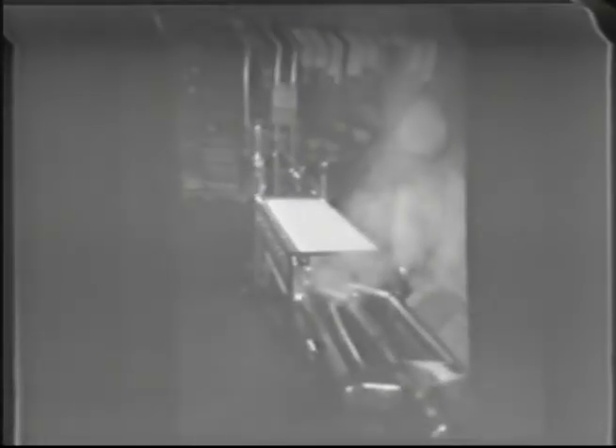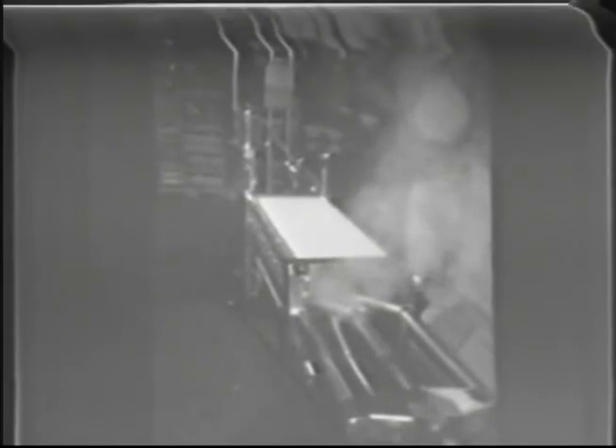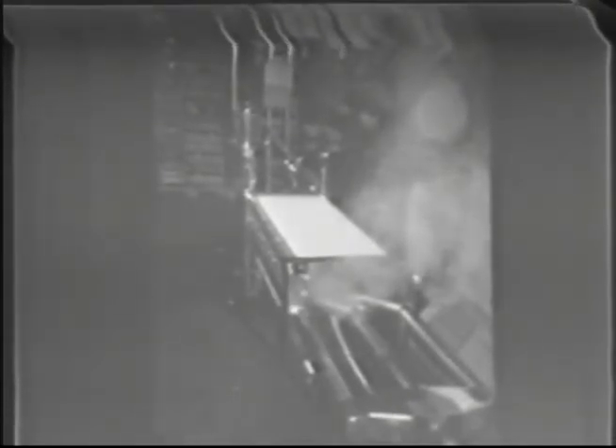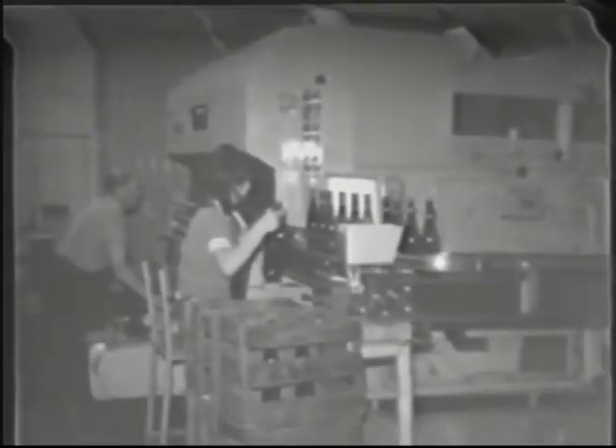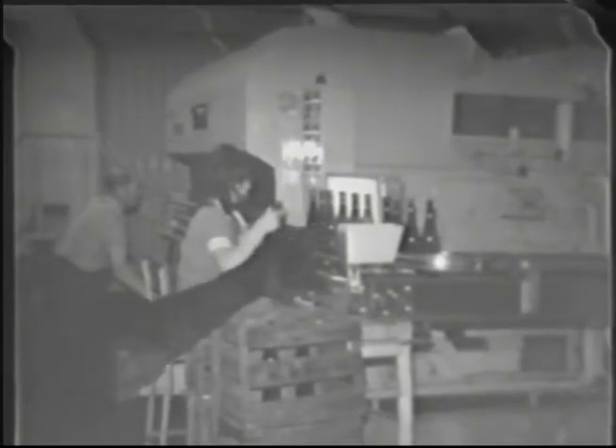This shows a smaller plant where I got there in time to see the sterilization — about an hour ahead of time before their run. They were using steam: here steaming the filter, here steaming the bottling machine. Here they were using washed used bottles coming out of the bottle washer, going in to the bottle sterilizer. I think they hand-sort bottles by height because if a bottle is an inch taller, the machine starts ripping off the neck. They are pretty standardized though because they do so much recycling.